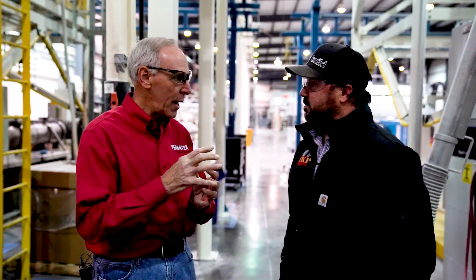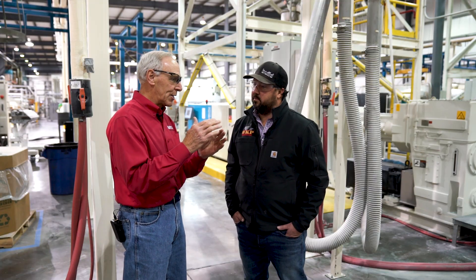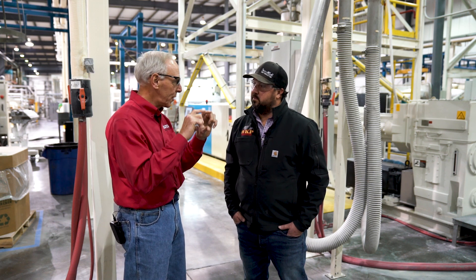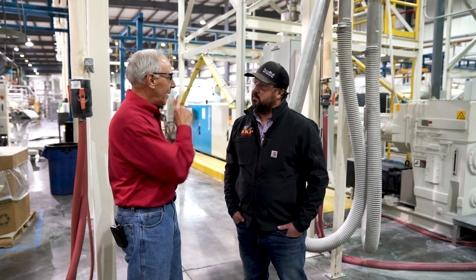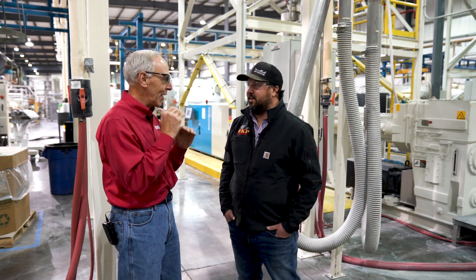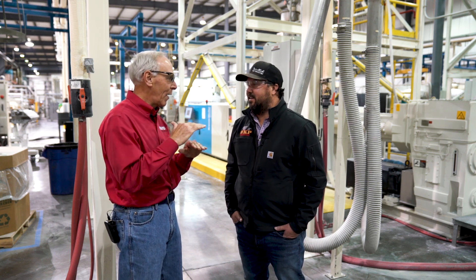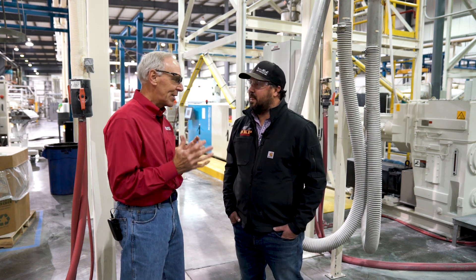Then it goes through the extruder with a vacuum to pull out impurities, into what's called a sheet die — a coat hanger die — and out the extruder. When it comes out, that's very key. Going back to the cake analogy: you take a cake out of the oven, as it cools it falls. As it comes out of the extruder, that product is 400 degrees Fahrenheit. It's going to go through a series of rolls and cool, and as it's cooling it will compress because the cells are trying to resist but they'll shrink a little bit. The art is: if I'm making a three-quarter-inch sheet, I want that sheet to be plus or minus twenty thousandths of an inch — the tightest in the industry. I've got to figure out, after about two hundred yards, I'm going to be at that thickness. That's the art behind the process.